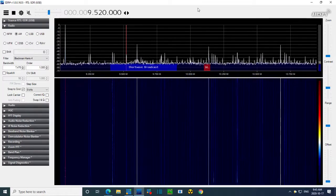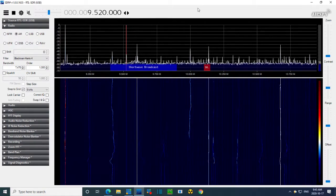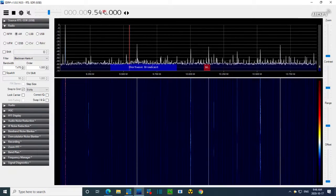Okay, I'm wiggling the tuning of the radio again to spot the local oscillator. Oh my gosh. What just zoomed up there? Suddenly there's something really big at 10 now. I don't know what happened. I don't think I was doing anything. Assumably the local oscillator is really on 10 now. I don't think this is working out at all. Because 9545 would be up there. 455 is going to get you to 10.